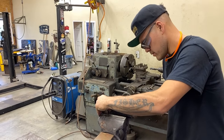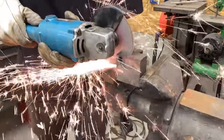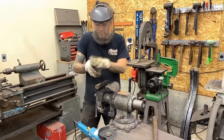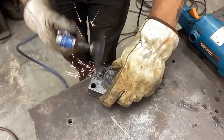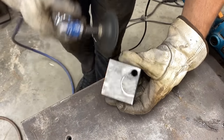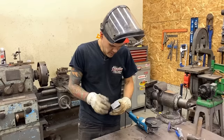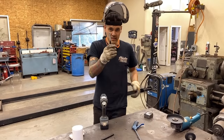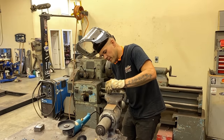The next step is just to make a little slot so that the sheet metal can slip in there. I'm just going to do that with a grinder. I'm just going to deburr the edges a little bit. Now that I sanded this, I'm going to run over it one more time to sharpen the edge in case the sandpaper touched our nice sharp edge while we were sanding around it.